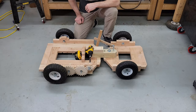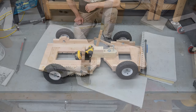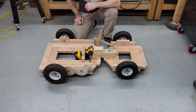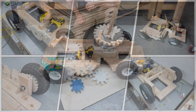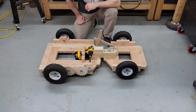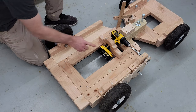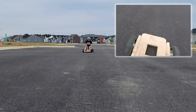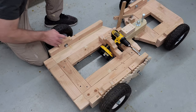And finally, that brings us to what is probably the 10th version of the cordless drill-powered crawl space caddy. The first physical version was done on foam board after I did a lot of sketches on paper and in PowerPoint. This has gone through a few evolutions, including the use of wooden axles even. I still have the wooden gears on here and that's probably going to change later because that creates a bit of extra friction that I don't want. Let's take a look at how well we're meeting the requirements so far. First, we can't have any fumes — that requirement is already met by using this 18-volt cordless drill. This has worked out pretty well driving on smooth roads, but it's going to be a little bit more challenging working inside a crawl space on rough terrain carrying heavy loads, so this thing might need to be upgraded.